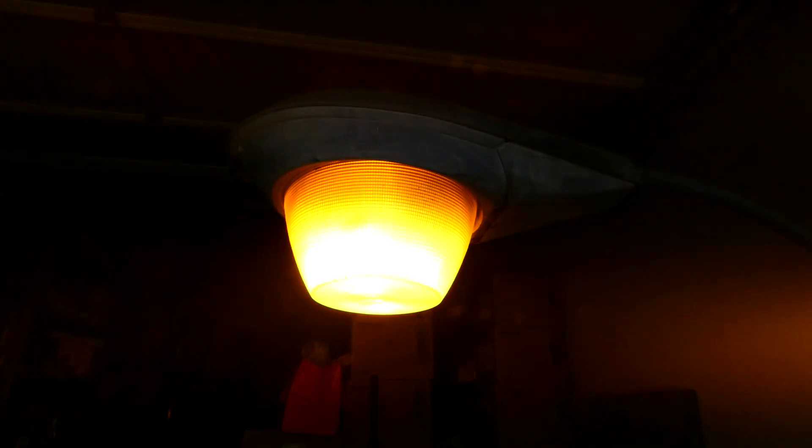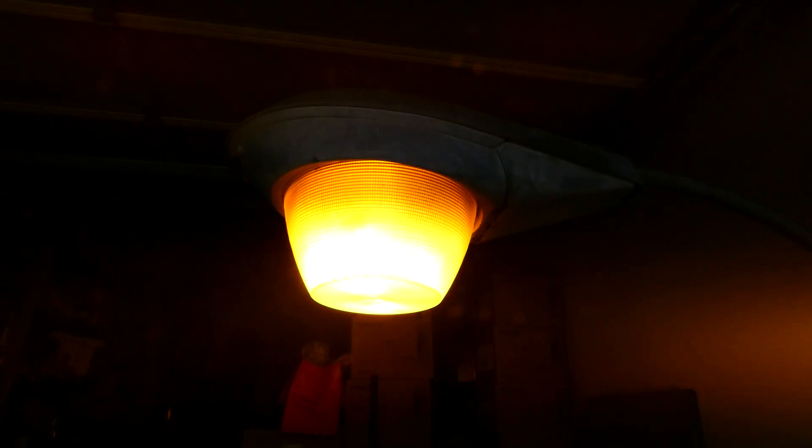It's definitely reached full brightness now and it's quite bright, of course — but that's expected. It is a 400-watt sodium after all, technically speaking. This is definitely an attractive option for places that didn't feel the need to re-ballast or replace the whole fixture for sodium. The only downside is that if you have a 400-watt mercury fixture and you don't want it brighter than it already was, you couldn't use these lamps — because they are the brightness of a 400-watt sodium while drawing 40 fewer watts. So that's probably why a lot of places didn't use them, since it still has to operate within the parameters of the ballast it's on.